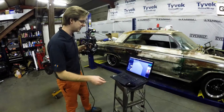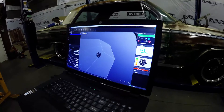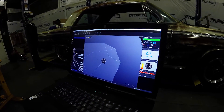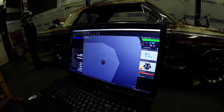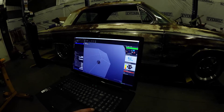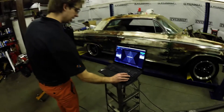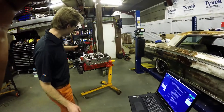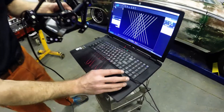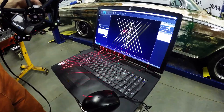Because this is an optical scanner, we have a specific shutter speed. It's putting out laser lines that bounce back to the camera and it has to read that. Depending on how shiny the surface is, we need to choose a specific shutter mode. There's a configuration for that — we can turn on our scanner and see the scan lines it's kicking out. You can kind of see them on my keyboard; as I increase the shutter speed the potency of these lines appears stronger.